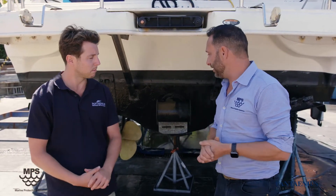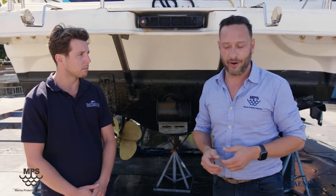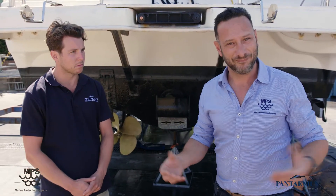This particular boat has got two very big shafts, big props, rudders, and trim tabs. They all have intricate componentry to enable proper operations. Maintenance on a boat like this is pretty important. You want to make sure you have no ropes caught around props, your shaft bearings are in good condition, and your rudders, rudder glands, and stern glands aren't leaking — because they can potentially cause a sinking issue. Regular maintenance is so important. If you fail to do maintenance, you can have a lot of growth on your seawater intakes, which are vital for keeping your engines cool. Without that, engines overheat and potential failure occurs.